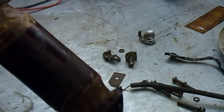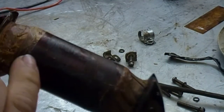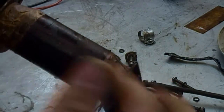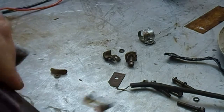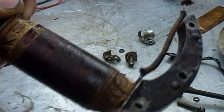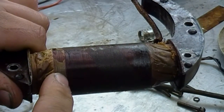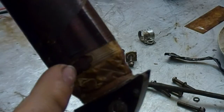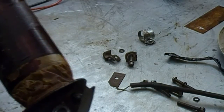What I'm going to do here is — this top layer of the winding is unusable. You can see where, in my removal of the wrapping, I gouged it right along here with the razor. But that's alright because I knew this was going to have issues, so at least we're going to redo the top winding. Probably take it down two or three layers, if not all the way. There's the first layer right here, and there's a piece of wax paper, and the second layer right underneath there. There's probably about five or six layers.